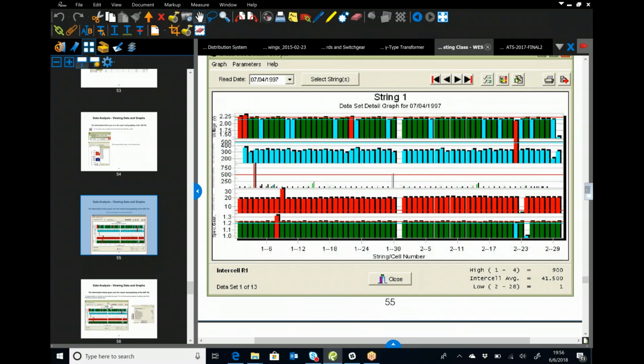But I've used them side by side with the Midtronics, which does the impedance and looks at that ohmic value versus the internal resistance. And I found bad batteries with the Albert that we did not find with the Midtronics. We did a 3-month-long side-by-side comparison of every string we tested. And that's all we did at the time was test batteries.